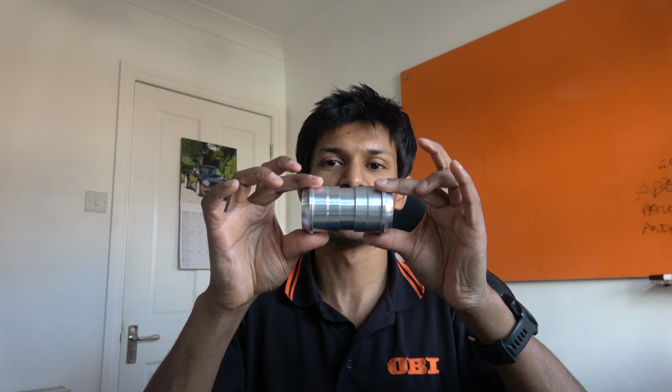Another aspect in all of this is dealing with thin wall metal structures. Thin wall metal structures are not easy to machine, because when you come along with your cutter tip and go near the metal, the metal deflects. It's almost like trying to scrape rubber from a rubber balloon that's been inflated. As you push your cutter in, the material deflects. As you go away, you think you've machined a millimetre off, and you'll find you haven't. So that's why I never CNC anything that's very, very thin wall metal.